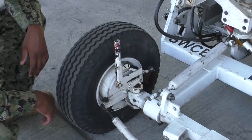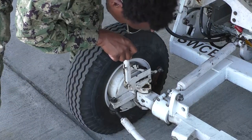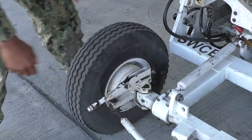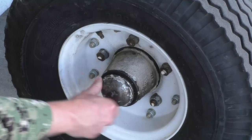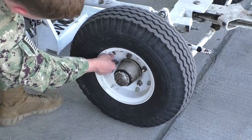First, we will start with the pre-op inspection on the brakes. Brakes should be checked for obvious signs of damage, effective operation, and placed in the set position. Tires should be checked for damage, particularly the steel wheel assemblies — missing chunks in tire tread, even wear of tread, bubbles or cuts in sidewalls, and proper inflation.